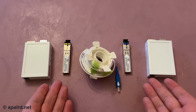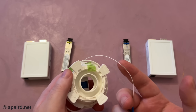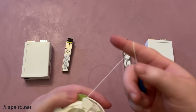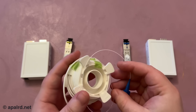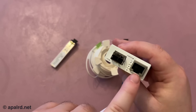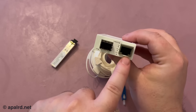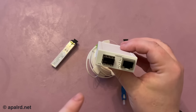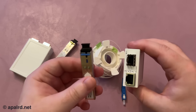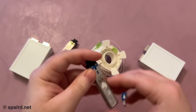Here are the key components of the kit. The fiber itself is very, very tiny — G657.B3 bend-insensitive fiber. You can bend it in all sorts of shapes you would normally never do with fiber. You get 40 meters on a spool. On each end of the fiber, we convert back to traditional RJ45 Ethernet using a media converter. There are two in the kit. They have an RJ45 jack you plug into your switch, access point, or laptop, and a transceiver slot which takes a pluggable transceiver. Two transceivers are included and pre-installed. This is essentially all the laser optics to send and receive Ethernet over a single fiber.